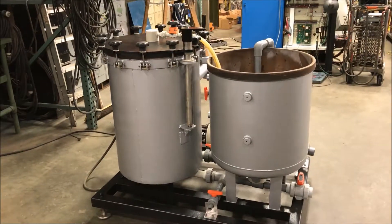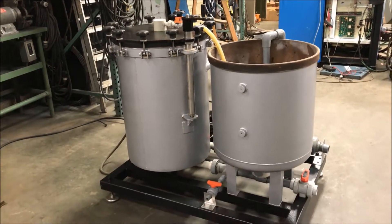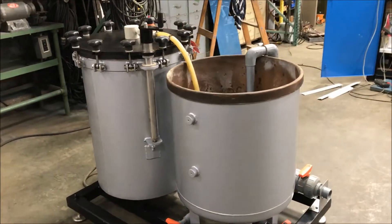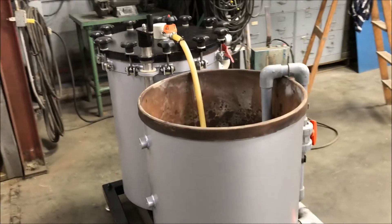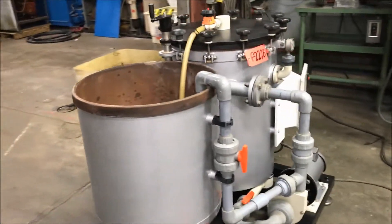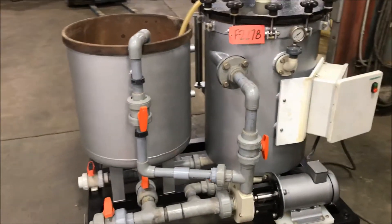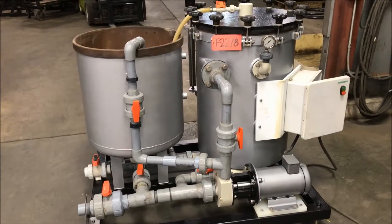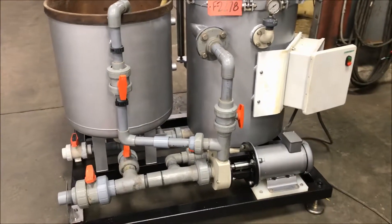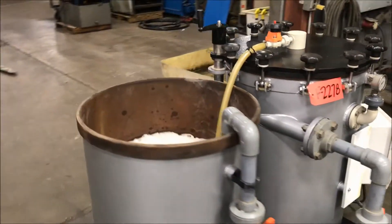This unit has 35 19-inch plates. Overall dimensions are 53 inches long by 39 inches wide by 53 inches high. It weighs roughly 1,200 pounds, has CPVC plumbing, and 62 feet of filtration area. Also, on the right, it does have a 3 horsepower pump wired for 480 volts.